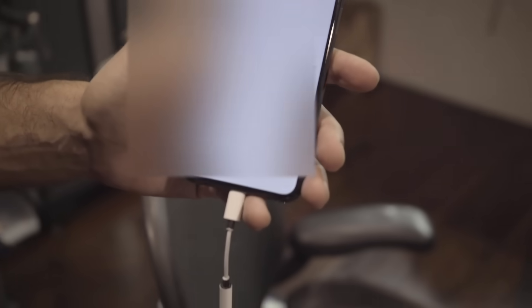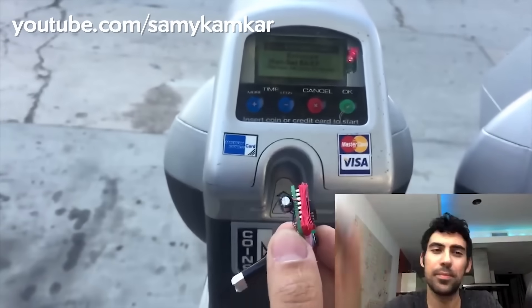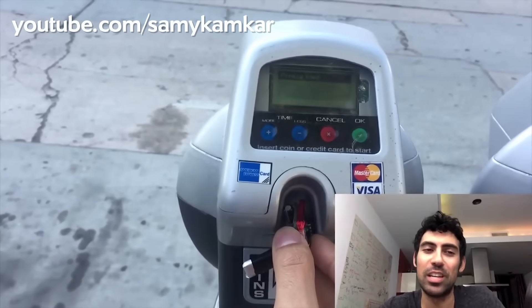So this is the second version. I'll turn this on. Take MagSpoof — this reader is only made to be used as a swipe. Authorizing. Processing. Please sign here. Approved. Transaction complete. When you're swiping, there's just a read head in the reader that's saying oh zero one zero zero zero one one — it really is like north south north south north south south. So I was just producing that same physical phenomena but through an electromagnet rather than permanent magnets. So when the current goes through the coil it produces the electromagnetic force, and if you reverse the current the reverse field is produced. Then I went to Target and bought something with a MagSpoof and I was like, oh my god, this is amazing. Sammy has an excellent video on his channel that goes into detail about the MagSpoof and how he made it — I'll put a link in the description.